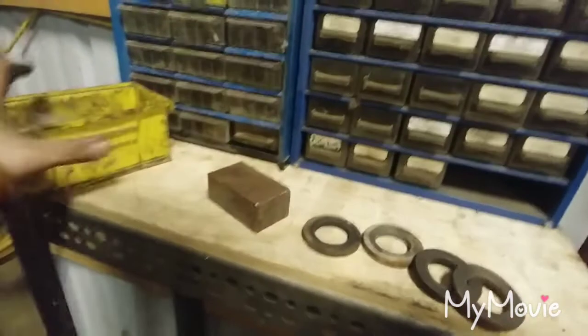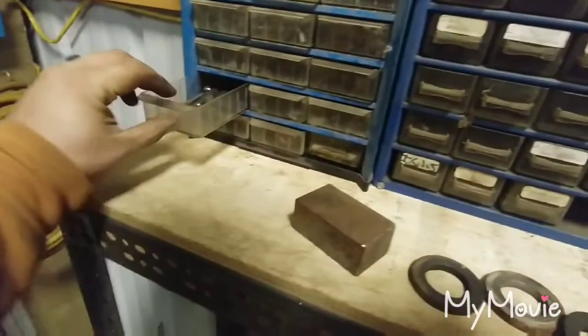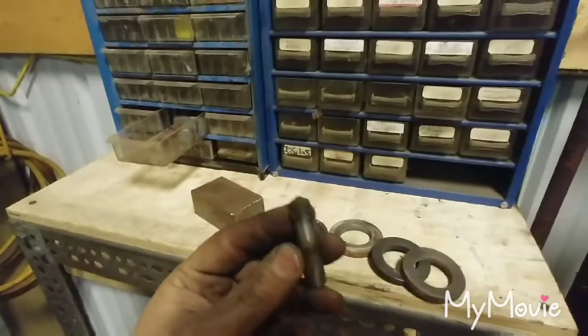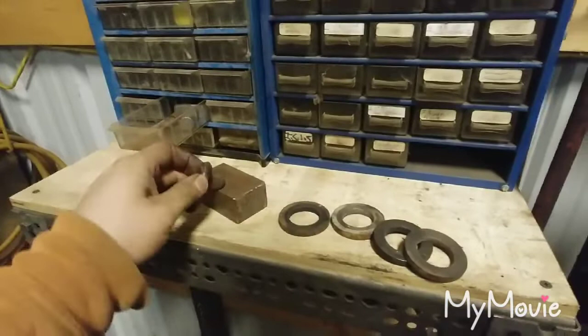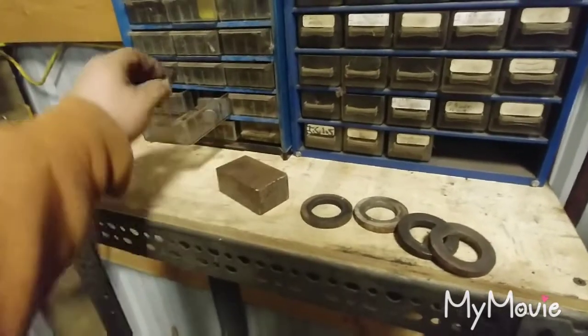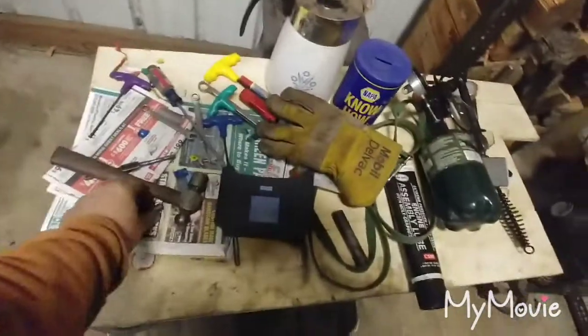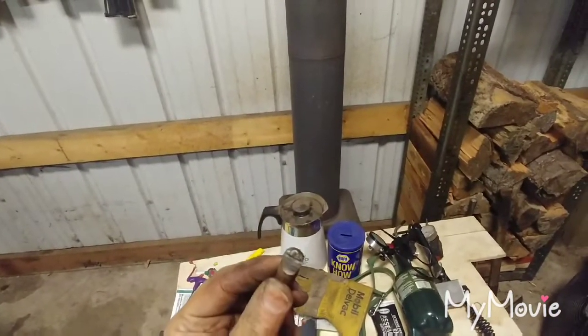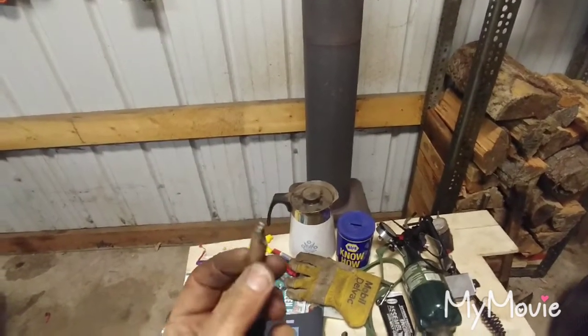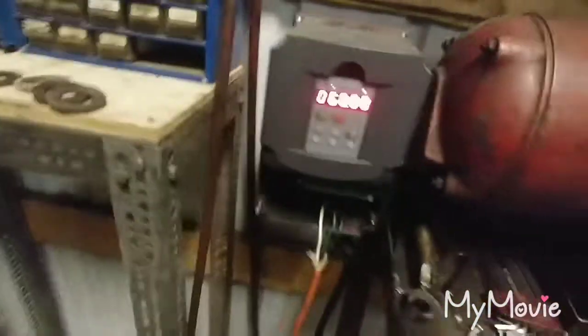I have this square stock here, and in one of these drawers I got some diamonds. I'm gonna drill a hole with a set screw — this is seven-sixteenths — and it'll sit in there with the set screw holding it, and then the mag base will hold this down so I can dress the wheel. Here's the one I want to use. It's actually got a diamond in it — when I was a machinist I ran into it with the surface grinder we had there. Anyways, that's what I'm going to use: drill a hole in there. Like I said, no judgment Friday.